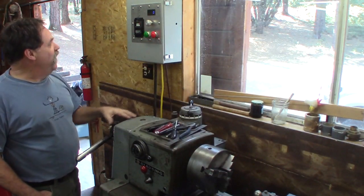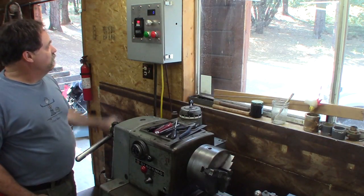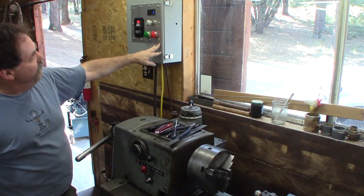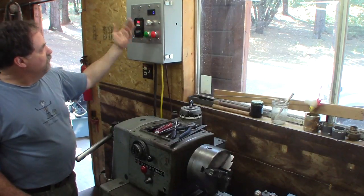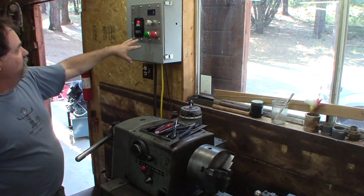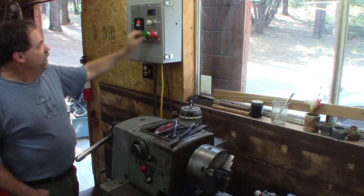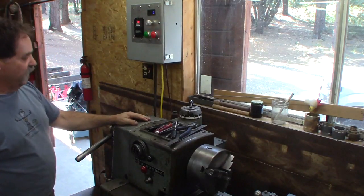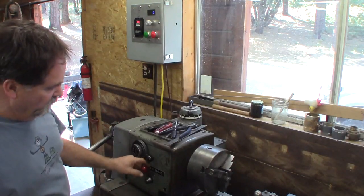The lathe runs. This power-up button and this whole setup acts as an emergency stop, but it's also the power off. It takes a minute for that to die down because of the capacitors. Anyway, this is the power-up button — it closes the relay. Speed control is here. I don't have the tachometer hooked up yet either; I have to mount the probe and figure out how to do that on the spindle.